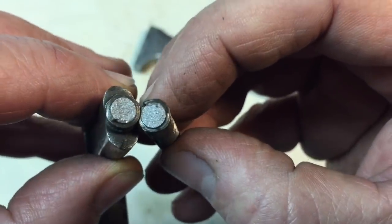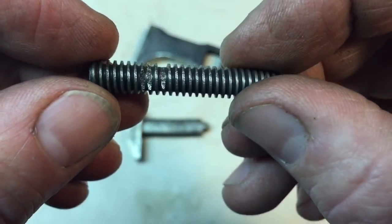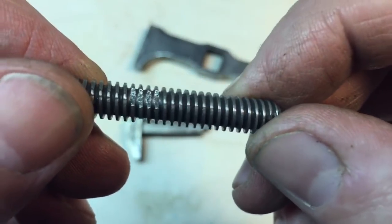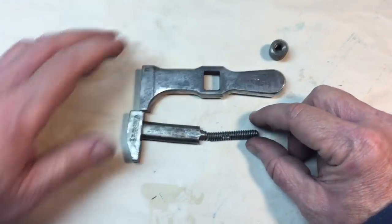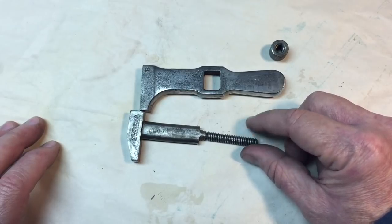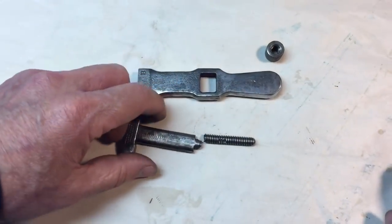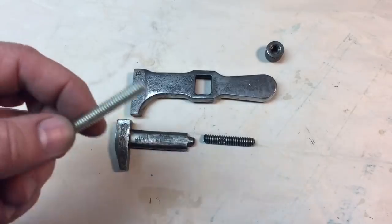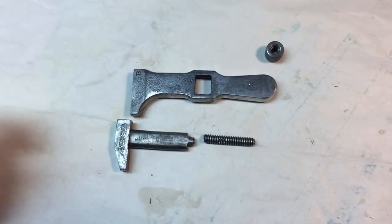It's a little porous on the inside, but it doesn't matter. The threads were messed up anyway — a little mashed in the front and damaged. So what are our choices here? Well I could toss the wrench, which would probably be the smart thing to do, or we can attempt a repair. I don't know if it's gonna work or how it's gonna work, but we're gonna try and put a piece of maybe stainless rod in there.